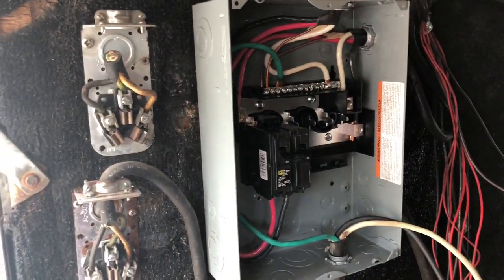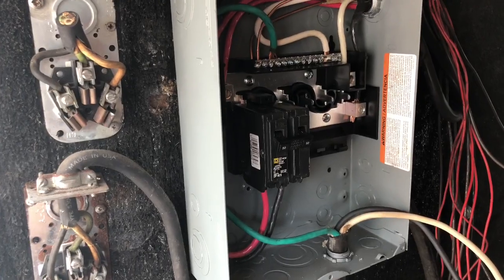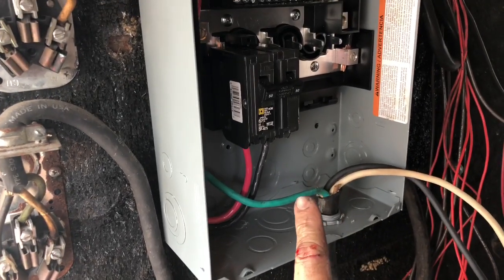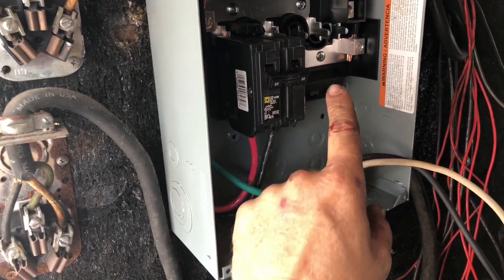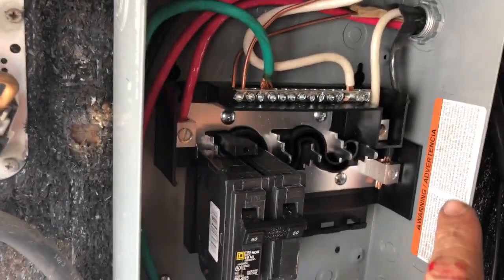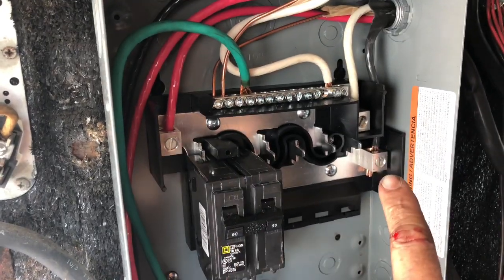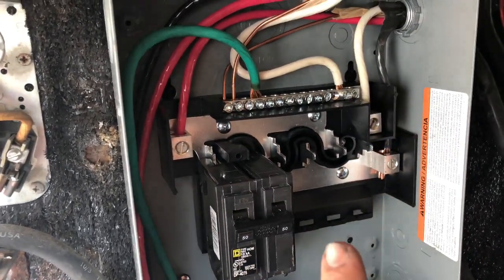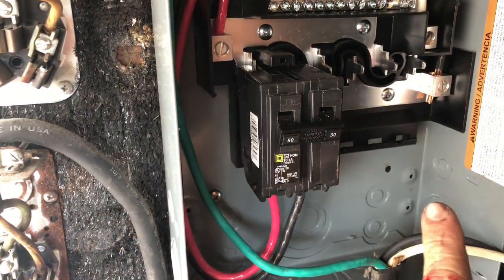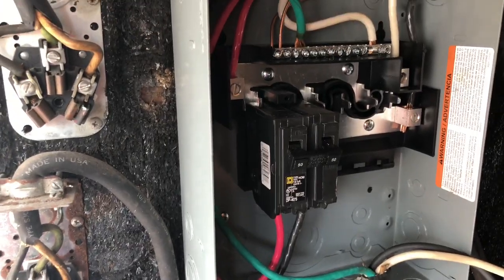What we do instead is take a standard breaker box. This whole setup cost $64, not counting the wire. We bring in the generator cord on one side — it comes up and hooks to a breaker on that side. Then the shore cord breaker comes up and goes out to shore power. We reverse and tie in the house electrical box in red and black, then white, and we do a common ground as well. So your generator comes into one breaker, shore power into another, and you switch which power input you want at any time.